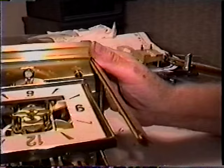The only place you do oil is the barrel arbor, the second wheel on both sides, and sparingly a little bit of oil on this ratchet wheel and ratchet axles down in here. Very, very lightly. You don't use an awful lot of oil like you do in an ordinary clock. All the oil in this clock is used sparingly, very sparingly. And now we'll set this aside.